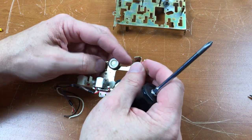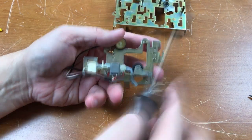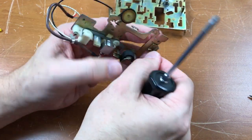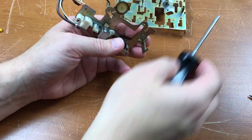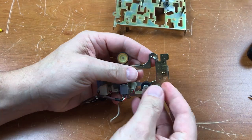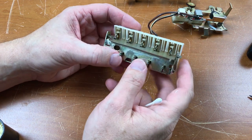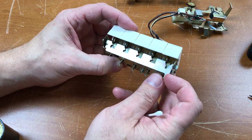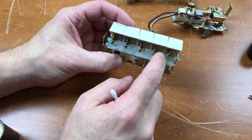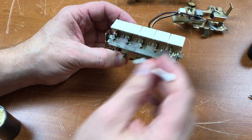I'll put the door stop hook on there. There's a little detent to keep it aligned. There's one more spring — it goes right here. Let's take a moment to talk about lubricant. I'm no expert, but it looks like all the residue of the grease I removed was white lithium grease. I tend to use white lithium grease on metal-to-metal contact and I think it's appropriate here, so I'm going to put a little bit of lithium grease on the linkages.